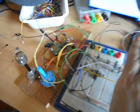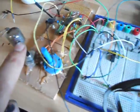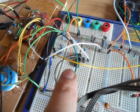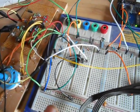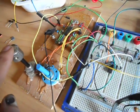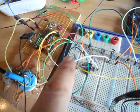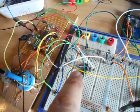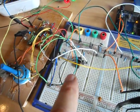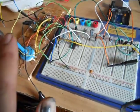What there is on that side is a little hack-together signal generator, and I've got a notch filter here so I can do distortion tests. So I bung a 1 kHz sine in. I was just testing it to see how well the notch filter came out, and it turns out the passive notch filter circuit, the bog standard one, which is op-amp buffered, turns out to be very good. But that's not what I'm talking about.